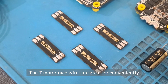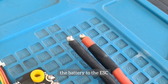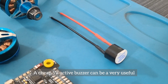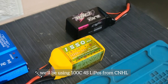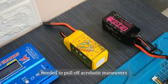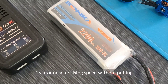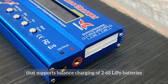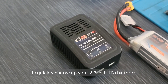The T-motor race wires are great for conveniently swapping motors without disturbing the soldering on the ESC. We'll need a male XT60 pigtail to connect the battery to the ESC, and a 35V 470uF low ESR capacitor to filter out power ripples. A cheap 5V active buzzer can be very useful to rescue your drone after a crash. To power everything up, we'll be using 100C 4S LiPos from CNHL. The very high discharge rating provides the extra power needed for acrobatic maneuvers. We can also use a 35C 2200mAh 3S LiPo for cruising. The IMAX B6 is a good entry-level charger supporting 2 to 6S LiPo batteries, and the E3AC from SkyRC is a reliable solution for 2 to 3 cell LiPo batteries.